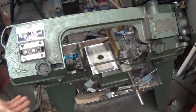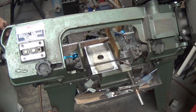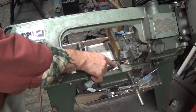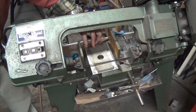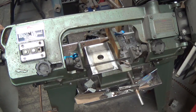And maybe somebody out there who's watching can tell me what I'm doing wrong. I've got the .023 wire in, and I've got the 75-25 mix, and my pressure is about 20. It starts out and it welds great, and then all of a sudden it gets porous. I skipped this end. It welded great, and then it got porous, and then the porosity went away. Coming back this way, it was a little porous. It welded pretty good, then got porous. A section in here is not porous. It comes and goes, and I don't know why.